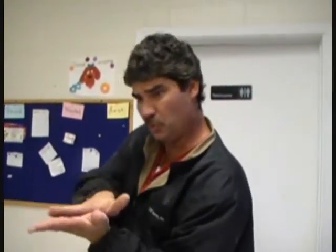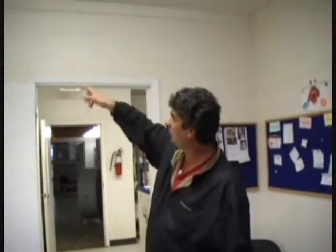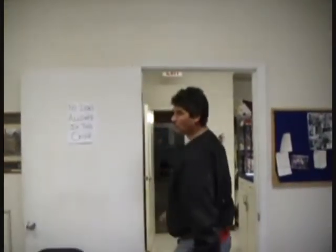Typically, when a brick wall doesn't go all the way to the top, they either put a piece of wood over the top of that brick wall so it seals up those holes, or they even concrete them so it seals those holes up. But in the attic up here, you can see all the way down the brick wall, and the mice are traveling back and forth up these tunnels. And they've got tunnels all the way to the floor.